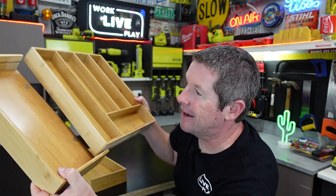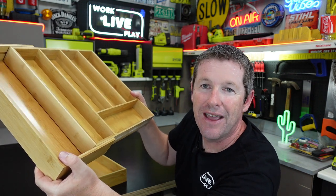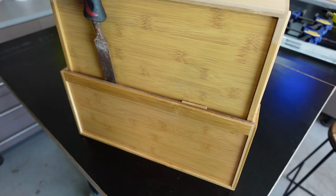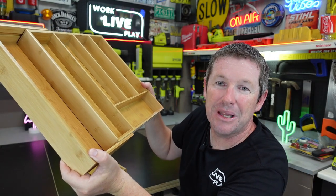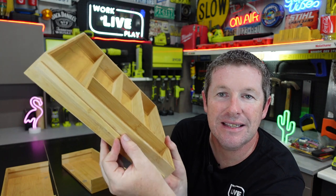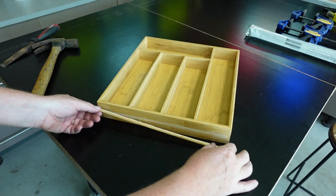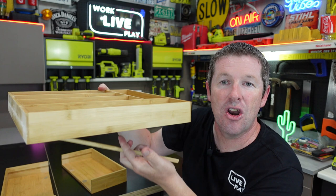Now skipping back a little bit, you'll notice that it has these slide out portions that you need to remove. It's just a simple case of knocking out the spaces with a chisel or screwdriver or something like that, that actually lock these slide out sections in place so that they can't be pulled out. That will allow you to pull this out and then you'll be left with these little runners on the side. The same way, you just get your chisel or whatever you've got and you peel these off so that you have a nice neat box to work with.